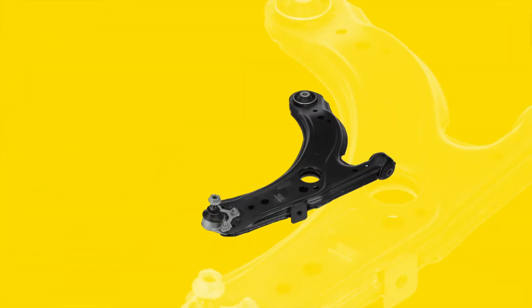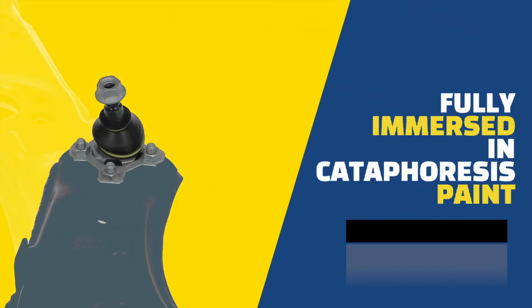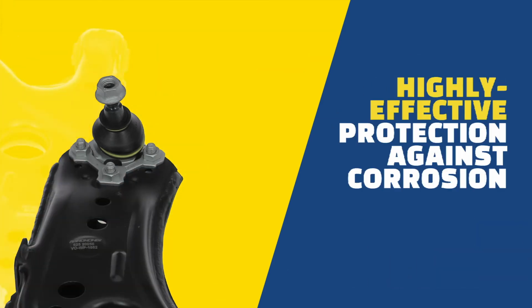MOOG parts are immersed in a bath of electrically charged paint that covers all surfaces, inner and outer, with a consistent coating. The part is then baked at a high temperature to ensure superior bonding and coating strength. The result is an ideal adhesion of the paint and a durable protection against corrosion.